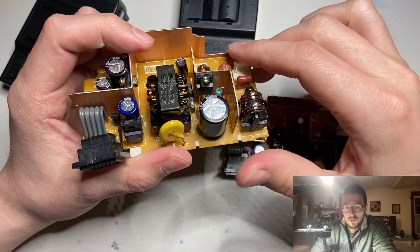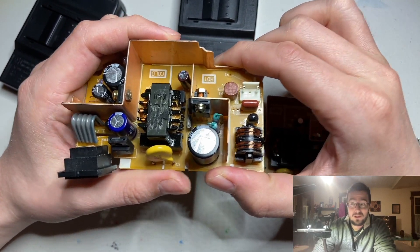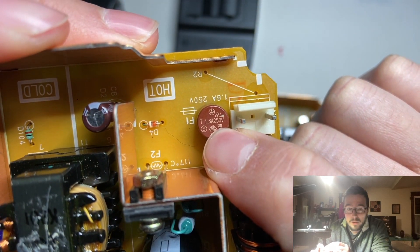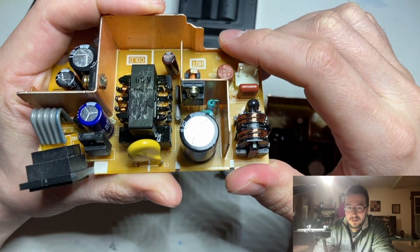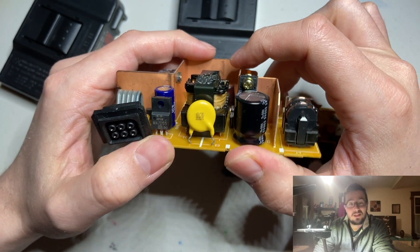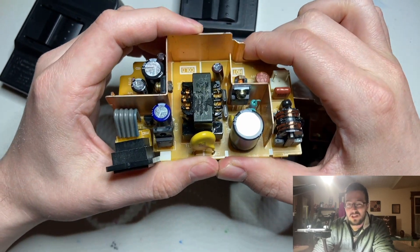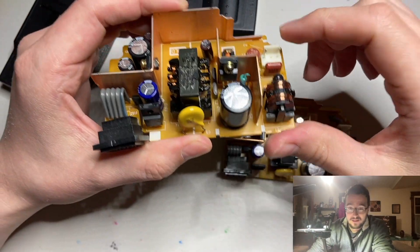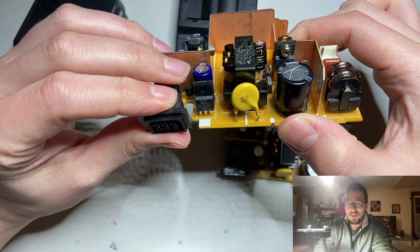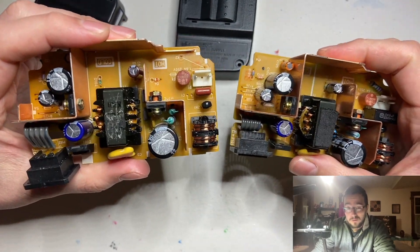It's probably all the resistor is doing is just building up heat over time. But instead of the resistor taking that heat — which is what it's designed for — that current is going to be creating more heat throughout the other electrical components, and that could spell trouble in the future. Then again, people have been using Japanese N64 adapters in the United States for probably 10 to 20 years now, and those systems seem to be doing okay. A lot of these fuses are rated for like 250 volts, meaning it's handling the North American voltage fine. But with these systems, 99% of the time it's going to be repeated long-term degradation that kills them, not a single stray voltage event.